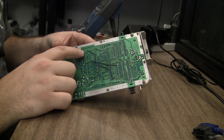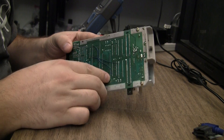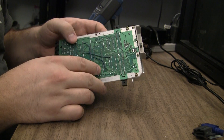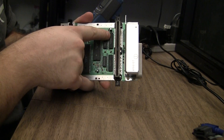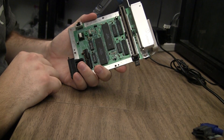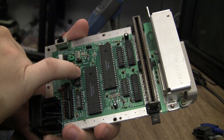I've repaired the two traces. Using a digital multimeter continuity check, pin 39 of the PPU goes over to a via, which goes up to the 373. Pin 30 goes up to the video RAM. You just take some wire and connect the pins and you can forget about those traces being messed up.